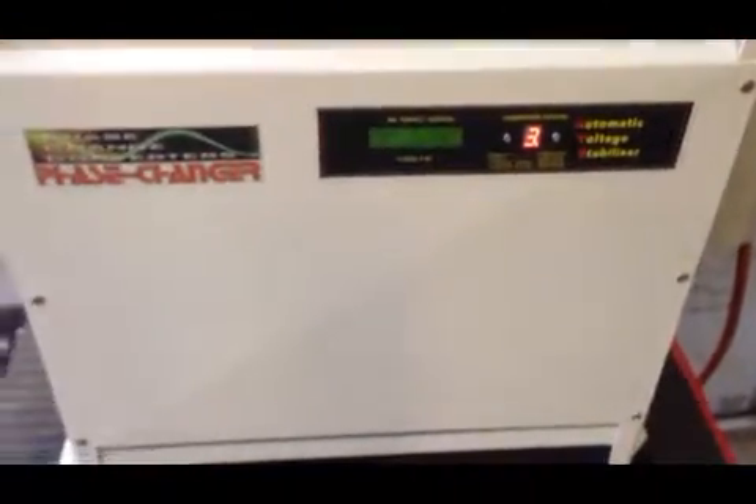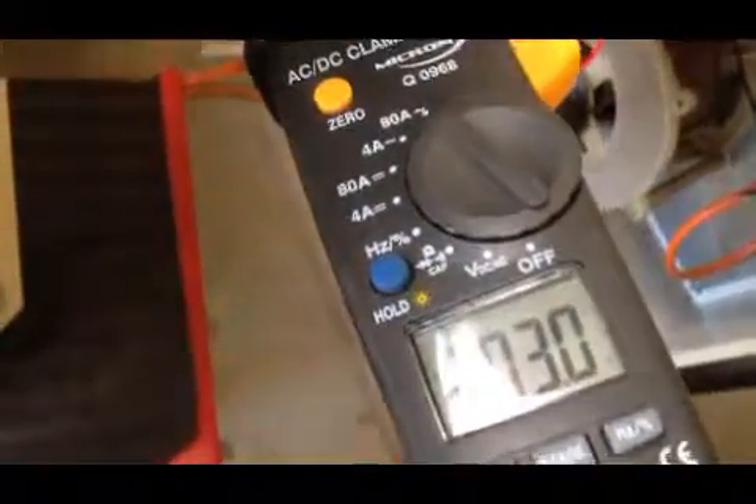So there we are sitting at 155 volts coming in and we've still got our three-phase machinery operating happily on the output side. To recap: input breaker going in, three-phase output breaker with RCD, start contactors, load contactors, a multi-tap transformer with a very special method of tap changing — all done with microprocessor control using the standard phase-changer controller from our phase changer series, plus capacitor banks. That makes up the 6-kilowatt AVS converter. Idle current at 240 volts is around 1.5 amps, and we go up to 8 kilowatts in the AVS unit.